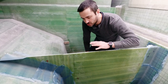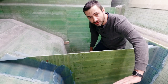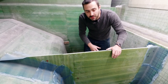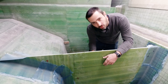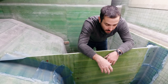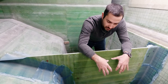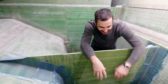The reason why we're doing this is the original location for the bulkhead is here. We moved the bulkhead further forward to give us a bigger engine bay, bigger space there. The engine's gonna still sit about the same location, but we just have more room to work on it. It's not gonna be tight along this bulkhead then. And what that's doing is giving us that cutout there, so we still have access to do everything, to get through things like the alternator and impeller, the water pump, the belt. All that stuff will be accessed through this ring frame area here. And I'll have a nice place to work right there.